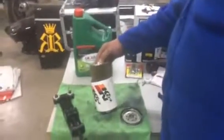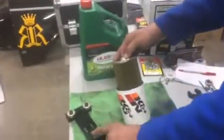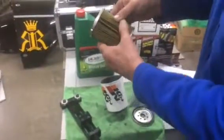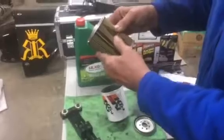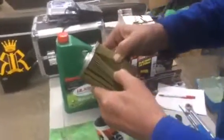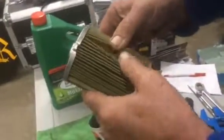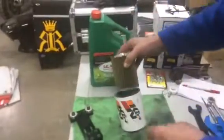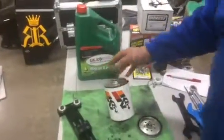We get the oil filter and cut it open with this tool here, and then check if there's any metal in there. As you can see, it's beautifully clean. It's a magnificent engine. It's been sitting here since the last meeting at Adelaide, and he put some good old ULX in it. We're all very happy and good to go.